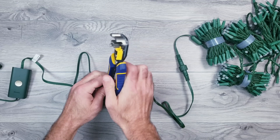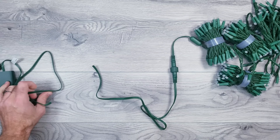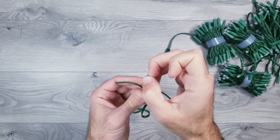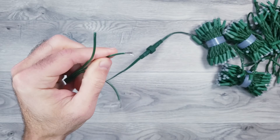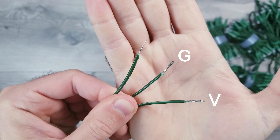The first thing I'll be doing is making a cut at about the halfway point between the Govee controller and the place where it gets connected to the beginning of the lights. After the cut, you can pull apart the three strands of wires and then go ahead and strip those back. There's going to be two thicker wires, which will be our voltage and ground, and then this third smaller one is going to be our data.